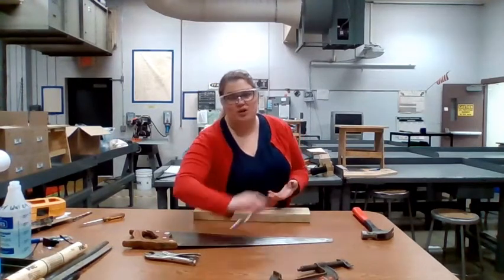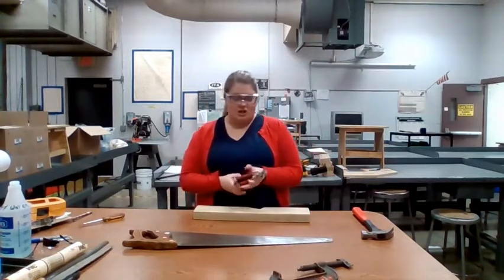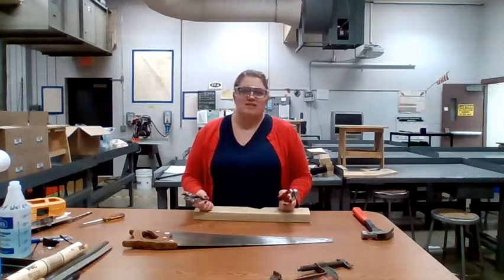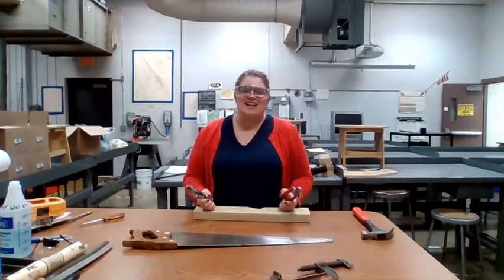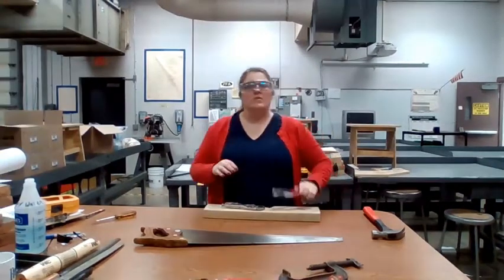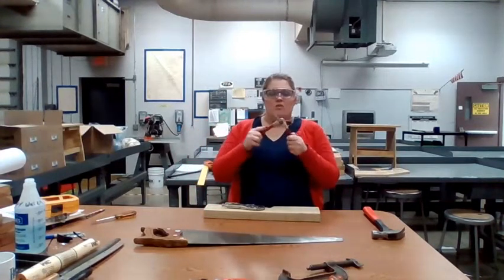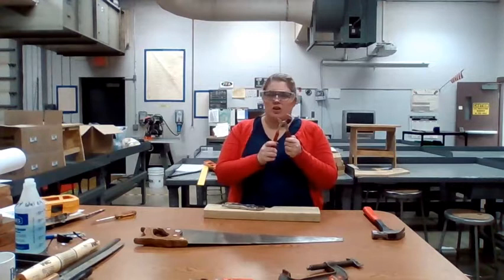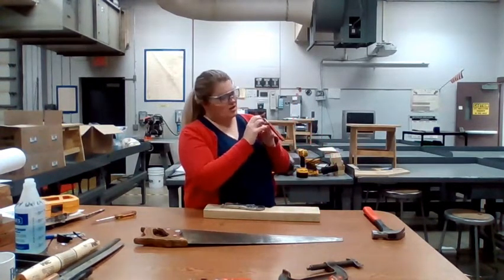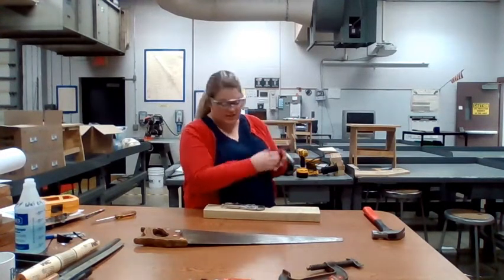Next up, we have a couple different pliers. If you're using bolts, you might need a pliers set to help hold. We've got some others around here in shop. These were just the ones that I wrangled right now. With Mr. Bergen's classes being out in shop, it's a little harder sometimes to find stuff because they're actively using them. So we have channel locks. They have a channel that slides back and forth. And once you turn it, there's a little groove basically in this side. And there is a piece that stands out, and they lock in at that point, so they won't slide.